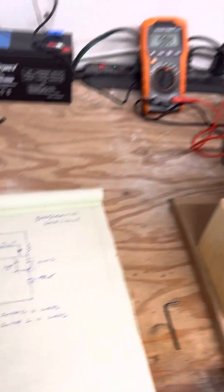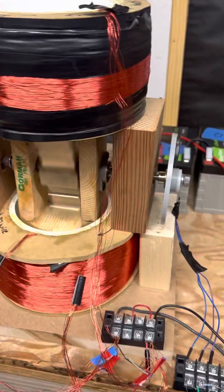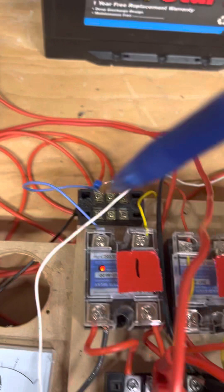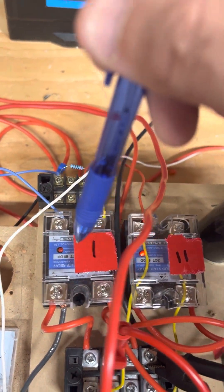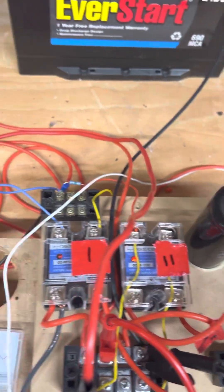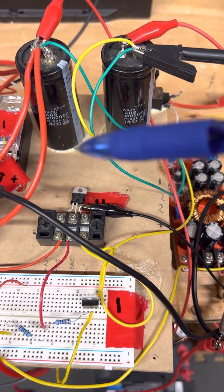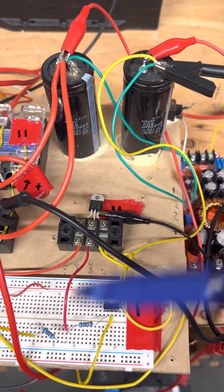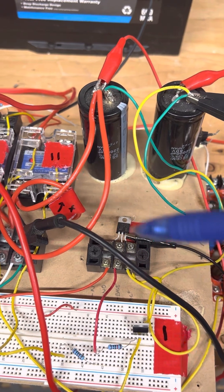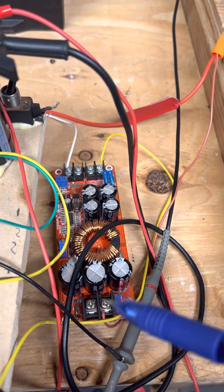Here's what it looks like — this is the old Newman motor turning just under 200 RPM. You can see the power bouncing, and these are the two switches: switch one and switch two. I did that by taking two transistors and stacking them — I don't know electronics that well, I just figured it out — basically one triggers the other, which triggers the SSRs. And these are the capacitors that are dumping. That's the boost converter taking the main battery from 12 up to 38 volts.